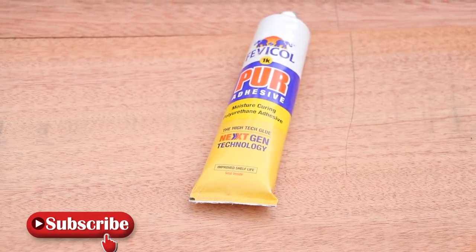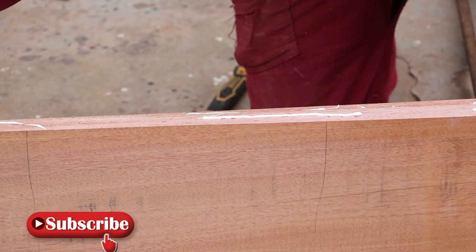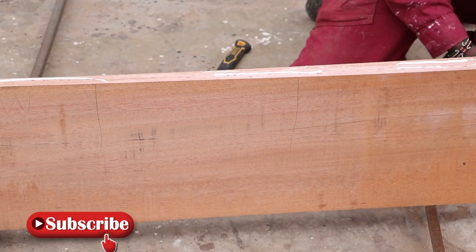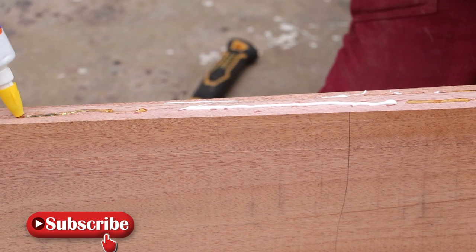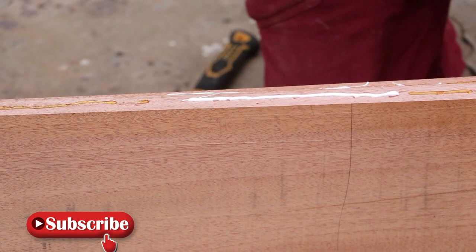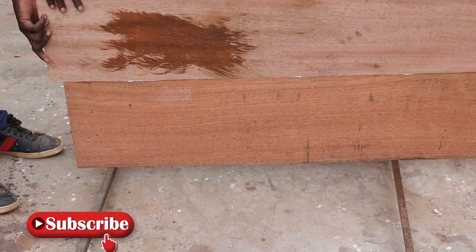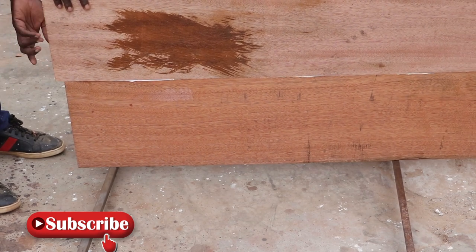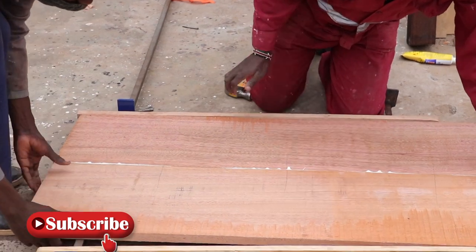To join a pair of the mahogany pieces, we applied Fevicol power adhesive and the ordinary wood glue. The reason we combined both is because the power adhesive dries fast while the wood glue creates a tough bond. We then spread the glue across the edges and used clamps to hold the pieces tightly together until they dried. We did this until we had 5 pairs.